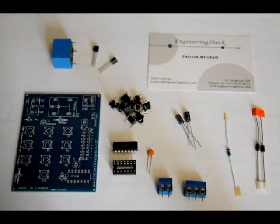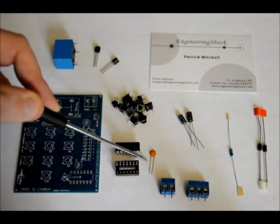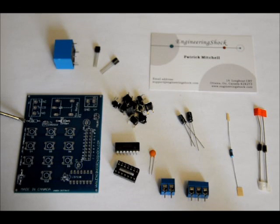Let's put in our single resistor and our 0.1 microfarad ceramic capacitor. The ceramic capacitor goes in the C2 footprint, labeled 0.1U, and our single 10K resistor goes in the R1 slot, labeled R1 10K. Since the capacitor is ceramic, there's no polarity — you can place it in either way. Same with the resistor, no polarity. Solder them into place, and then we'll place our diodes and electrolytic capacitors.